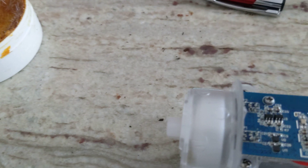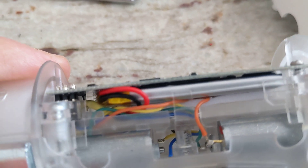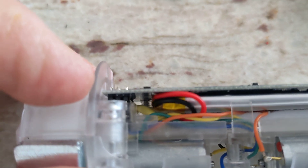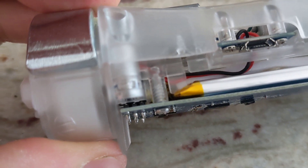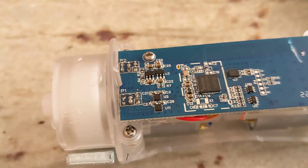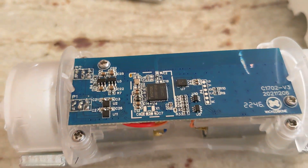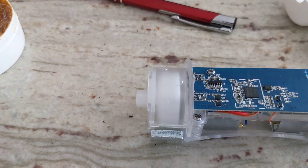I did disconnect this from one I got from Amazon. When you take this board off, the battery has some adhesive — you sort of pry that off. Take these off, unscrew, and then this board removes, and underneath is the little black PCB. You can pop that out by pushing it downward from the board. It's actually connected to this little plastic thing — it'll pop out. Then you pull your leads off out of the black pin thing, cut it, and re-solder it to the new battery after you've removed the JST that you had.